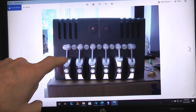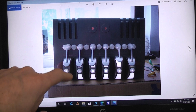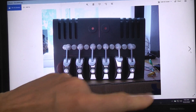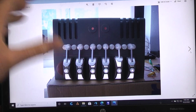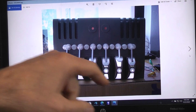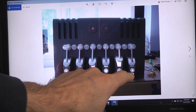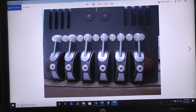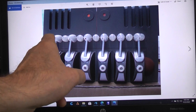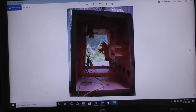You don't want to run your sax motor moving the sax valves without the sax rests in place. Because when the rests aren't there, these can tip back further than they normally would, which means their stem on the inside is aiming up higher. So when that cam comes around it'll just hit and lock everything up. You need to run the motor enough to know you got the direction right and the wire color-coded correctly, but once you've done that, resist running it until after you get all the sax rests in place so things don't jam up. There's a hole where that shaft shines all the way through — once you've got everything done and trimmed your shaft, take a little bit of glue and glue up the end holes so there's no way it can slip out.